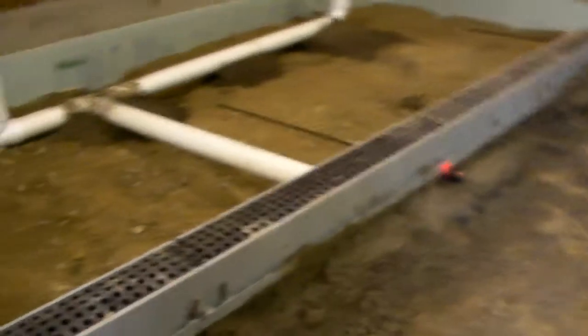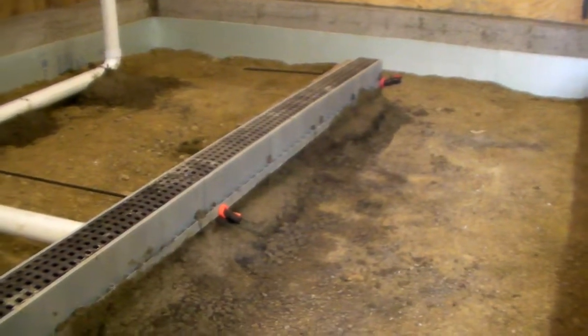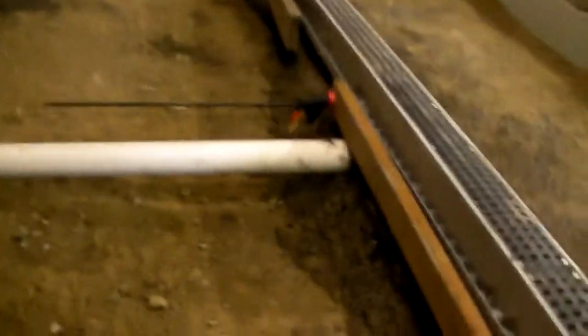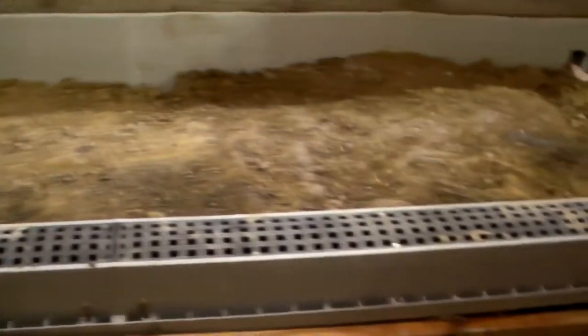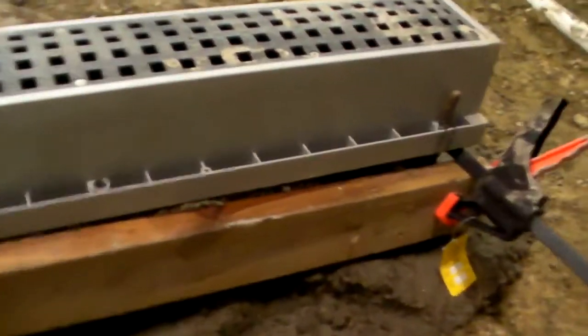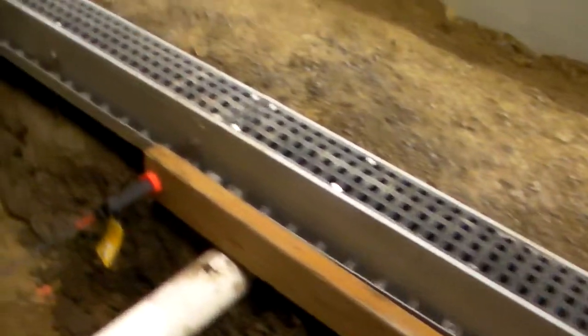Let me show you real quick. There's no way I could get concrete to stand up like that, and I ended up doing a lot of separate pours — separate packings, if you will. What I found worked out really well were Harbor Freight furniture clamps holding 2x4s and stuff on the back side. I used a stick to push that concrete in, really pack it in so you can see that it's coming out the other side. I've got a very secure footing under there.